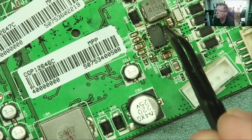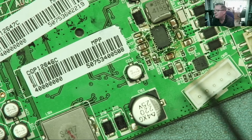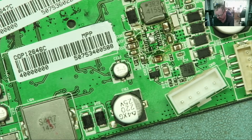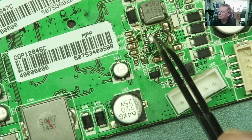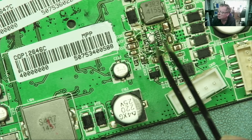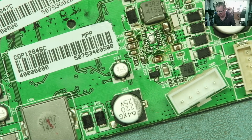I may have to just give it a little bit of help. I have plenty of them, so if I make a — to use a technical term — pig's ear of this, then I can have another go. If you would do it a different way, let us know in the comments below how you would go about it and why you would use a different method. I think there's probably too much solder on here, by the way. So I've added some fresh solder, but what I don't want to do is get too much in the center here so that when we drop the chip on, it kind of squashes outwards and shorts to any of these pins down the side. It's very difficult to exactly quantify this — kind of get a feel for it is the best advice I can give you.